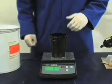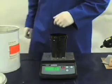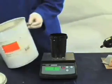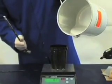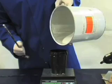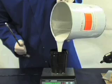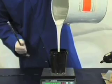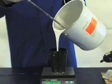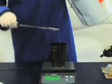Now I'm going to show you the silicone mould making. Make sure you've got your pot and your scales. Your pot is empty on the scales and you've zeroed it. Then we take the silicone and just add the required amount. You can see that it's quite thick and runs quite slowly, so just be careful when you're pouring it out — pour very slowly and carefully. Once you've got the required amount, have a stick in your hand so you can wipe off the rim of the tin so it doesn't run everywhere.